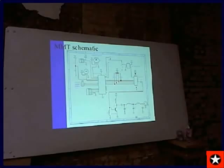This is the schematic of the transmitter. As you can see, it has the typical sensors of battery voltage and internal temperature. I can put on an external temperature sensor. I can also sample pressure or ambient light. Any number of sensors that you can put on the outside. I'm running everything at 3.3 volts because that's what the frequency synthesizer chip likes to run at, and my clock reference. I'm using a very unique way of frequency shift keying here, which also allows you to FM modulate this.